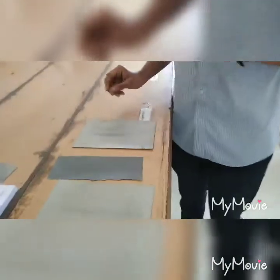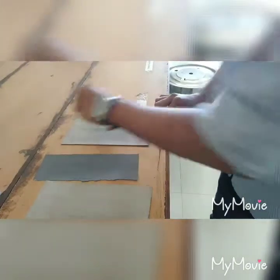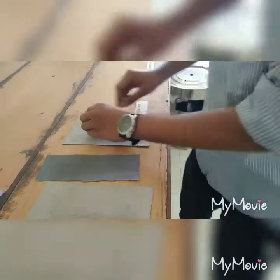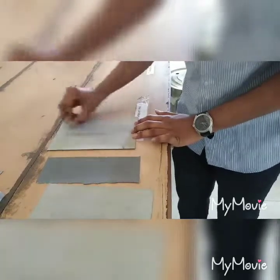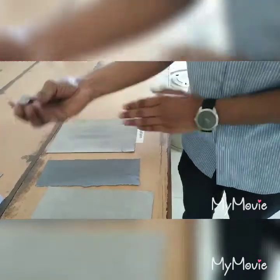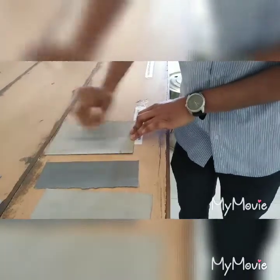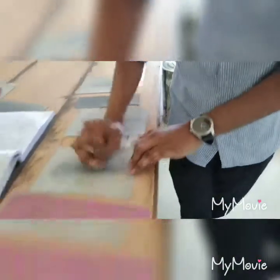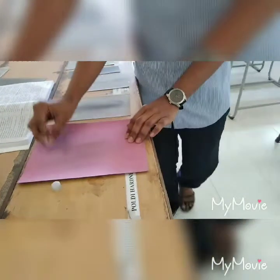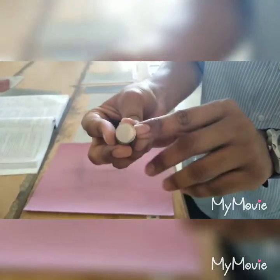You hold the specimen in your left hand and slowly move it on the emery paper in a back-and-forth motion. Ensure that the scratches introduced during this stage of polishing are perpendicular to the scratches obtained from the belt grinder. Then further polish on 2-0 emery paper, then 3-0, then 4-0, and then 5-0 emery paper in this method to get a superior surface finish.